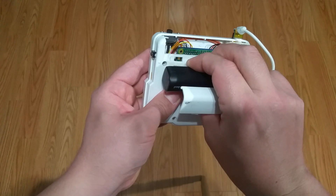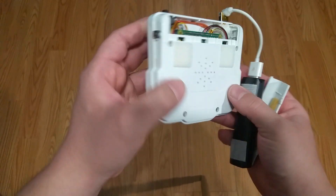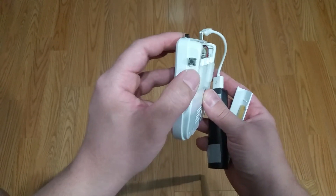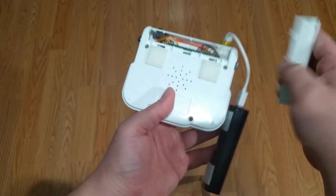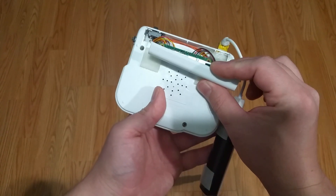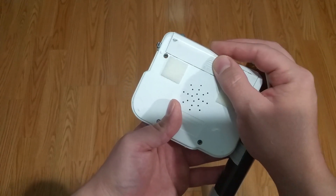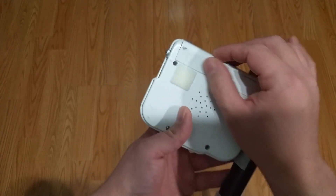I'll open it up and show you where the Raspberry Pi is — just pull the battery pack off. It basically populates the space from about here to right around here. From the side, almost the entire bottom back half is empty and not populated, so at some point I may be able to put a lithium-ion in there. Currently I don't have any vents on it, but I played Streets of Rage 2 and let it run for quite a while — the hottest it ever got was 57 degrees Celsius. The Raspberry Pi Zero is rated good up to 80 degrees, so if I start having issues I'll just put some vents on the back.